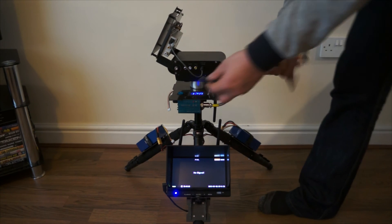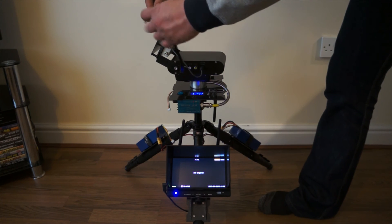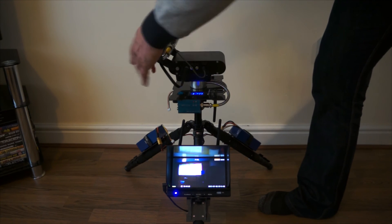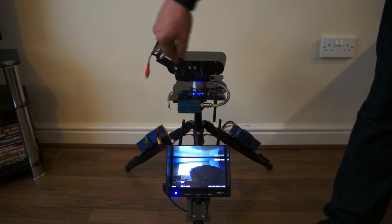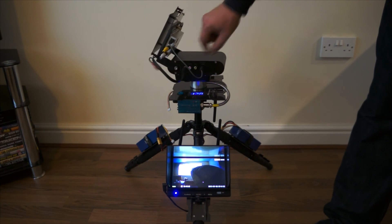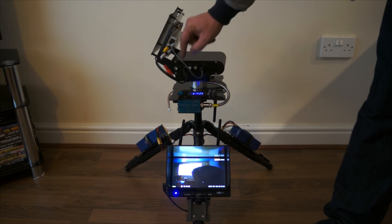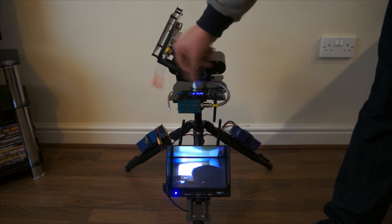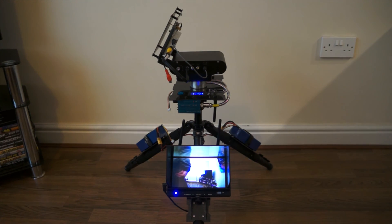So there's the DC jack. Now with the headphone jack — the 3.5mm jack plug — I'll plug that in. I'll put the audio in just for neatness. We've got a picture. Now when we move the cable about, there is no problem. We can put many, many twists on it and it doesn't break the picture up once. Switch it the other way — no breaking the picture. That is a much better way of doing that instead of using RCAs.